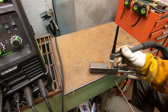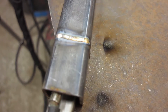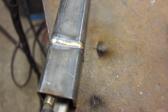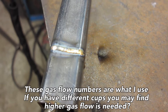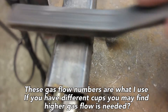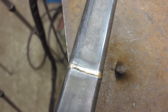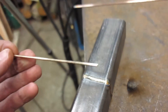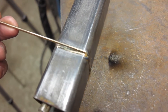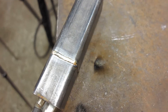We'll bring you in to check out that joint. Here it is. I found this stuff kind of likes a little bit higher shielding gas, that's why I'm running at about 15 — kind of like I was with the quarter-inch plate — or it'll oxidize. I haven't taken the wire brush to it yet but that will clean it up a little more. It's just got a nice quality look to it. I found it lays on pretty nicely with just the lay-wire technique, where you literally just lay the wire in the seam and follow down with the torch and blend it. That's how I lay it on and it works pretty well.